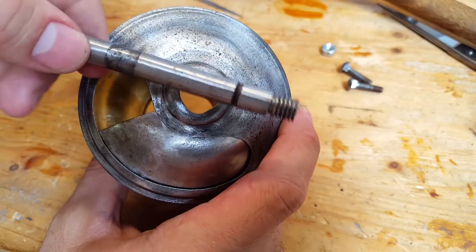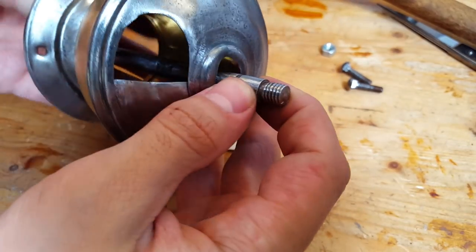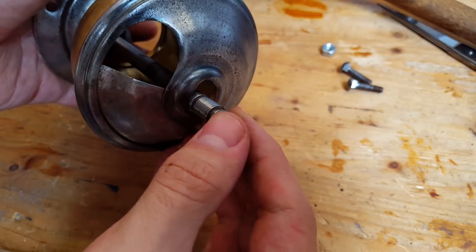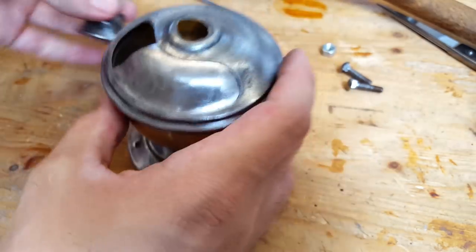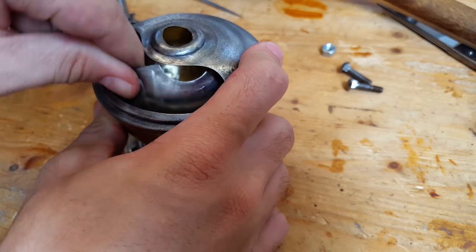The second problem was somewhat an aesthetic one. With the one guide bushing developing significant play, the main shaft started touching the edge of the hole on top, which led to both parts cutting into each other. I would like to hide this somehow and prevent the cutting effect from happening again.